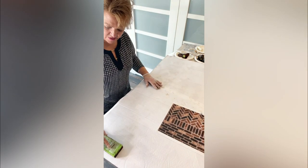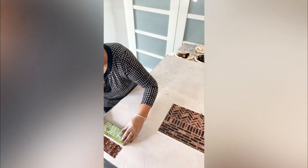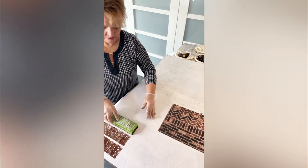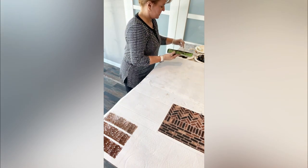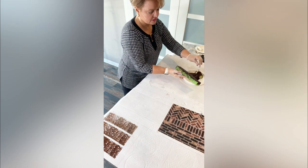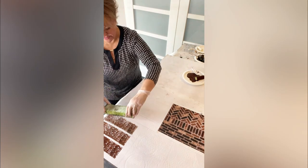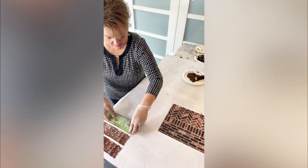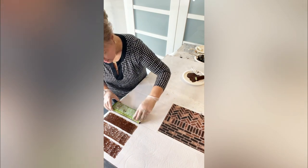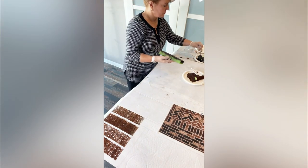Starting off with walnut, I'm just going to use my cardboard here to get a good straight line. Envision this is the bottom of your backsplash — down near your countertops at the bottom edge. Just using this roller and rolling off some of the gel stain right onto my mop. Now, this is not going to wash out — just know that. You may need a couple of these tools. Since we're using gel stain, they're going to be goners after this.